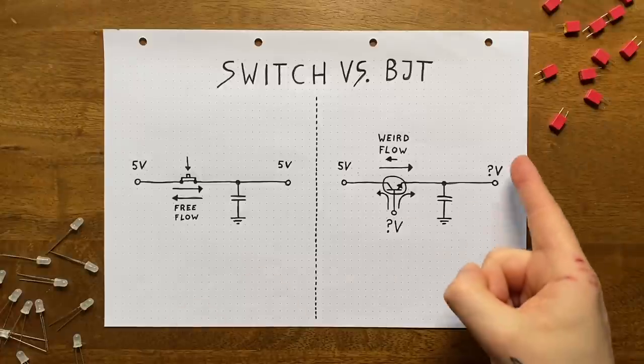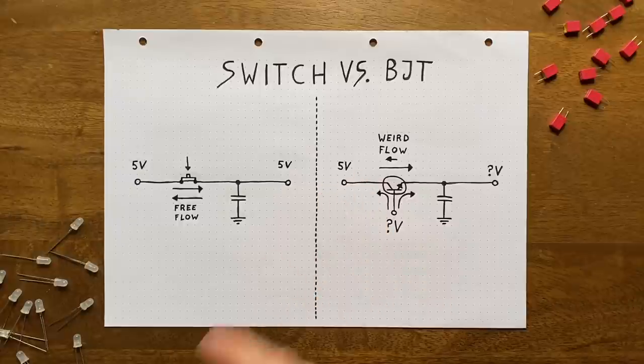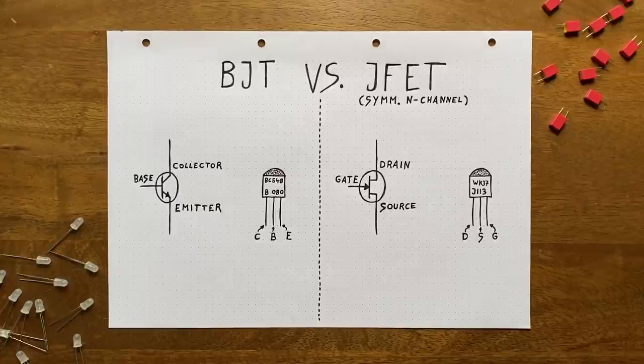As a result, the held output voltage will rarely be the same as the supposedly sampled input voltage. That's not to say that it doesn't work at all. It would just be a fairly sloppy implementation. I've put an example circuit in the description that you can check out if you're curious about this. Thankfully, there's a different type of transistor that is better suited to our use case, the junction field effect transistor,